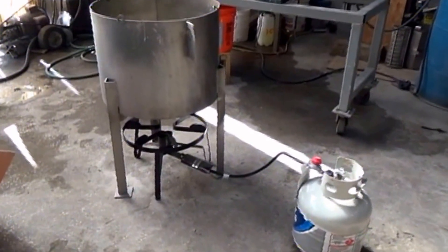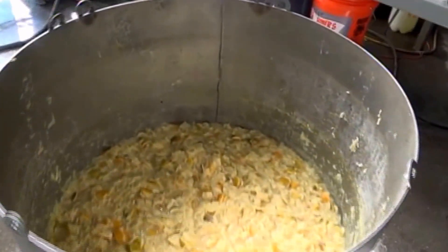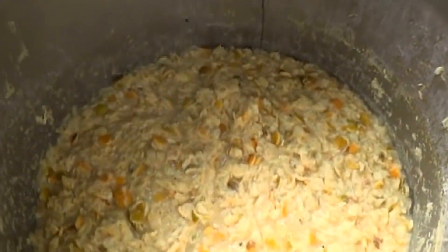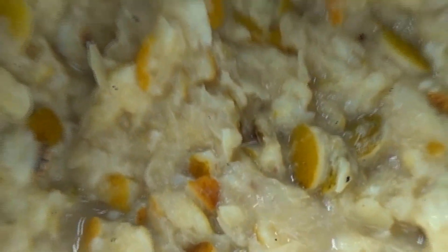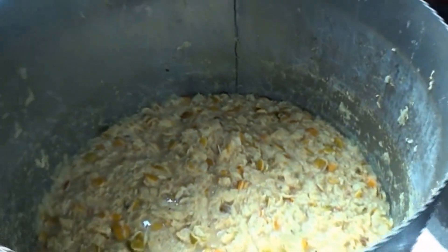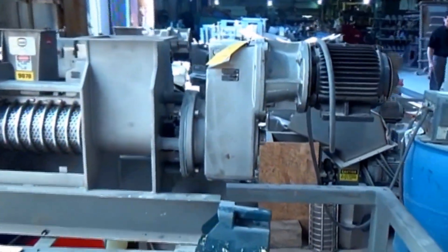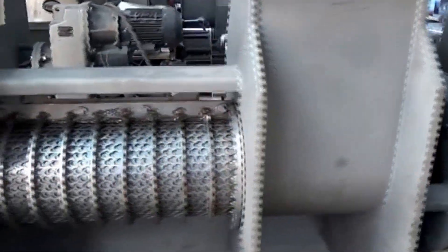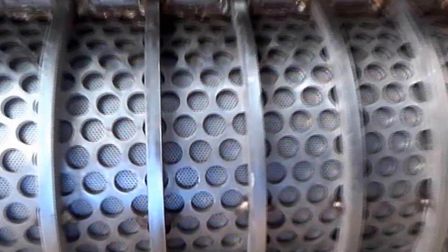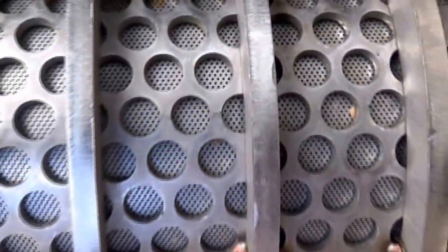This is the material we're going to test. This time we heated it up — not using the double boiler, just applying direct heat and keeping it stirred so we didn't overcook anything — and it's citrus. We're going to run it in this press right here. We've got it up to 170 Fahrenheit, kept it stirred so we didn't burn any. And a fine perf screen — looks like 0.023 or 0.033 perforated screen.